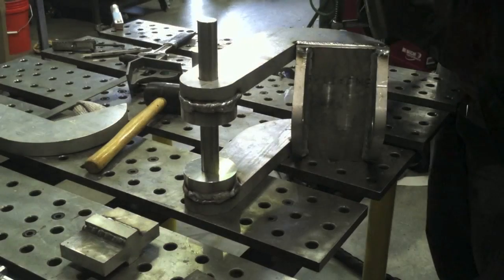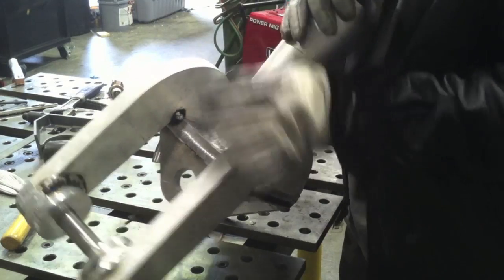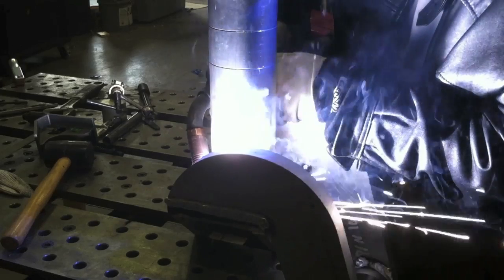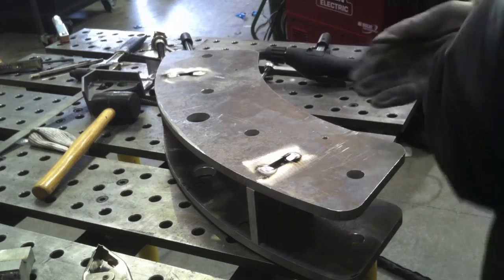It's grooved out about three-eighths of an inch. I know it's going to pull outward to an extent, and you can see right here the pin is now locked tight — won't move. It was loose, but when I weld those insides it's going to pull in quite a bit. I'm thinking that when I get finished welding those inside filler welds — especially since they're grooved out as well — it'll pull in enough to loosen that pin up and it'll float freely again. That's the goal. The pins being able to fit in there and not bind up is one of the main things when welding up a fabrication like this. Nice and loose again — every now and then you'll get a win.